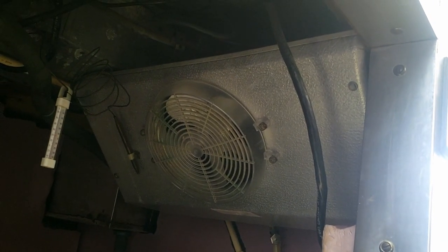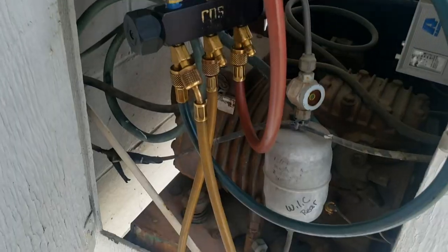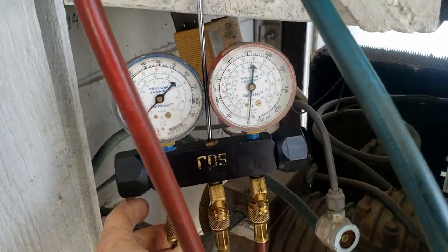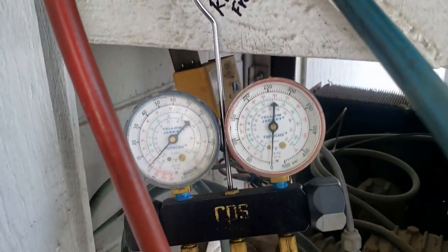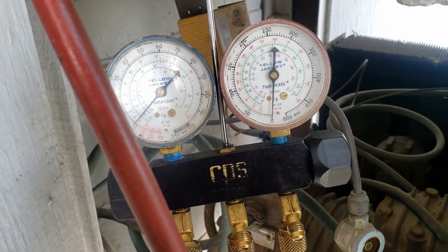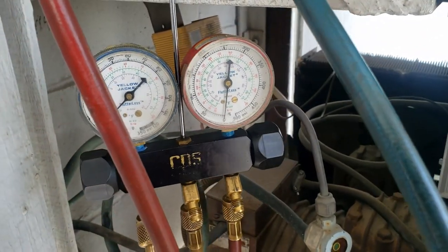I went ahead and unplugged it because this is how they turn the evaporators on and off - they just plug them in. They've got a thermostat that loops one leg of power down and back again to make the compressor run. Since my pressure's really low and they pumped it down, I'm assuming it's got a leak. It's R22, so I've got the leak detector warming up. I'm going to pop that front face cover off and see if there's a solenoid in there. There's no pressure in there so it's probably not going to trigger the detector until we add some. One big advice: when you have issues like this with no suction pressure, make sure you put the high side gauge on there - you may end up having something pumped down in one of the valves. As you can see, we have nothing - this thing's completely empty.